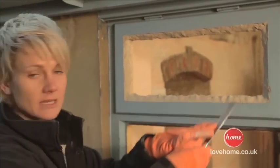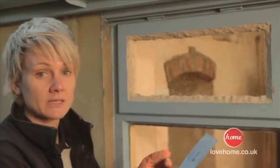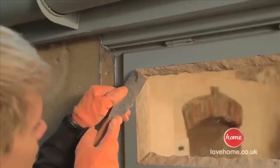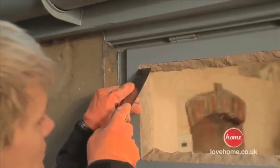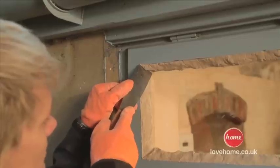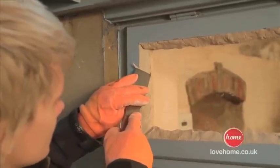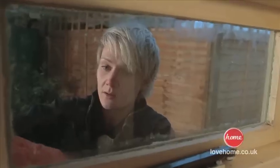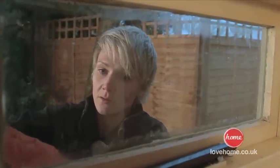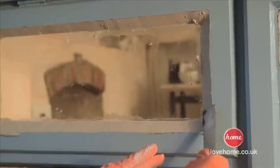So when I slide it down over the putty, I'll peel away the excess, but I won't be pulling the putty out. Okay, now when I go into the corner, see how I angle in? I'm not going in like this, square on. See, angle, and then slowly pull down. Best to always go one way with your knife. Don't worry about if it looks a little bit messy, a little bit greasy. All of this will clean off with just normal window cleaner.